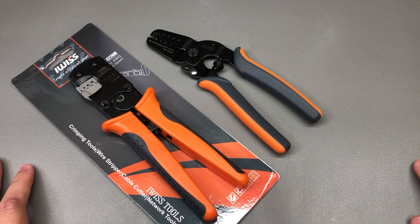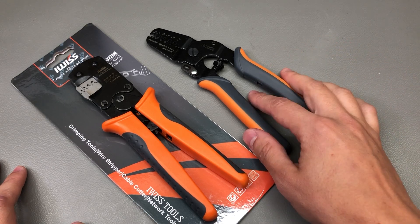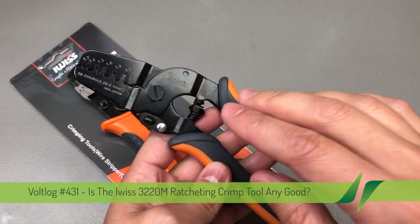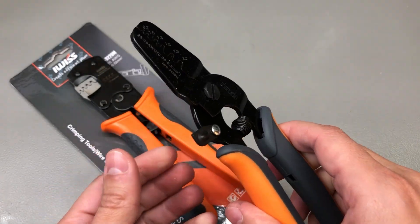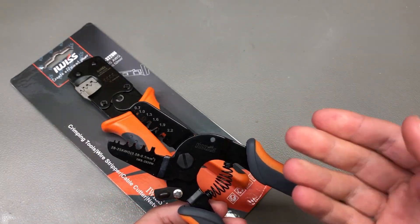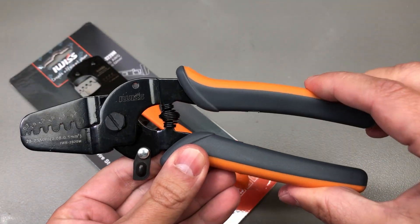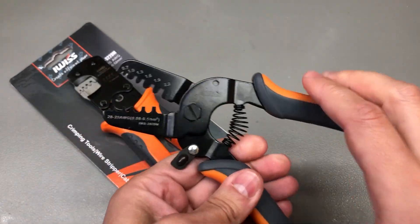I have a couple of popular videos on my channel where I take a look at some affordable crimping tools. The most recent one being video 425 where I looked at the iWIS Mini 2820M. This is a dual action crimping tool meaning that you have to crimp first the insulation and then the electrical connection. It's cheap, it works, but it does require a bit of extra work, a bit of extra attention for correct positioning of the crimp on the die, careful applying of force, and just a lot of practice on the user side to be able to get a usable crimp out of these.